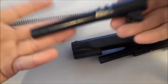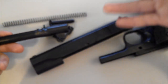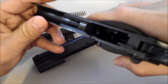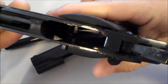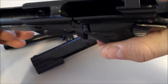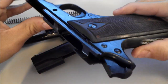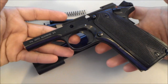It's basically the same thing as a 1911 teardown. The frame is just about the same as a 1911, but it's less complicated, and the mainspring is shoved way in there. The trigger is not a 1911 trigger mechanism, and the trigger action bar runs through this part of the grip frame. To put it back together, look it up on a 1911 forum — they have all different types of diagrams and pictures.